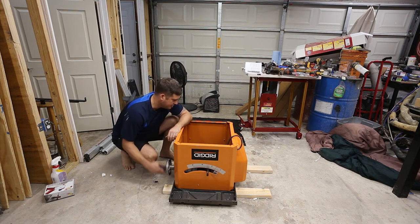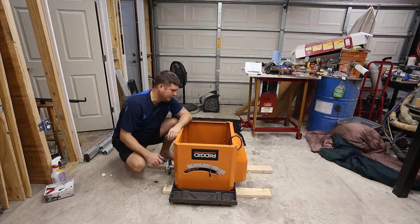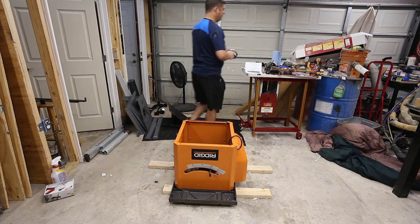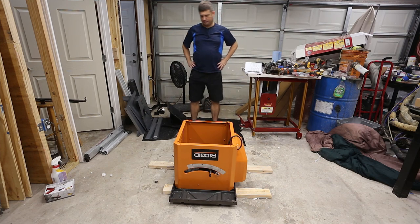Funny, they refer to this as a totally enclosed fan-cooled motor, and it's actually almost a TEFC. The capacitor is exposed, so it's not a TEFC, and that's actually a misrepresentation. In a true TEFC unit, no part of the motor would be exposed to water, dust, dirt, bugs, or air. Only the outside would be exposed. It's kind of funny how companies will sometimes use marketing like that.